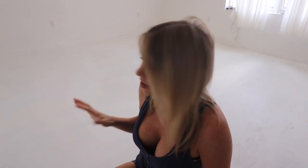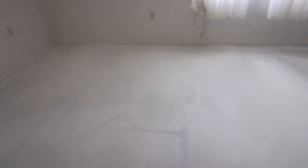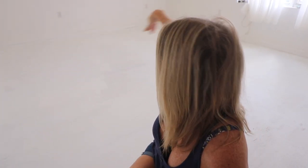This is the morning of day two. I just wanted to show you what the floor looks like with the first coat of primer dry — it looks pretty good but there's still some lines showing, so I think one more coat of primer is the best move. I also want to mention why I painted it in a diagonal pattern rather than straight across: I was going with the grain of the wood. Wood generally behaves much better if you go with the grain, so just keep that in mind for your floor.